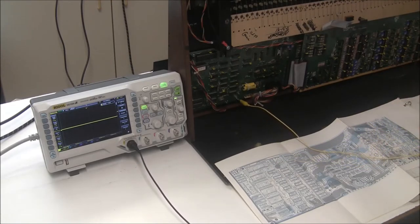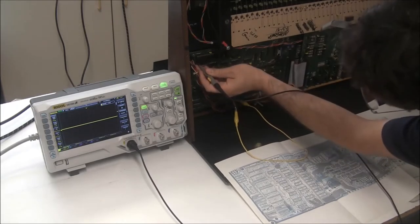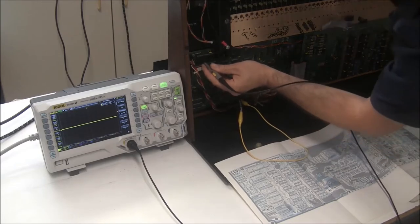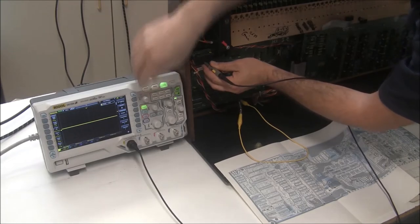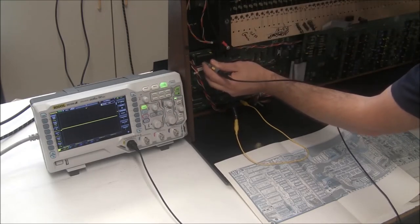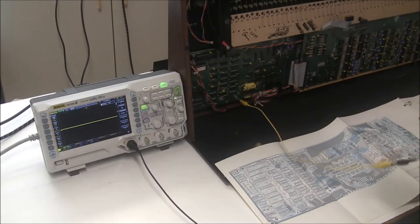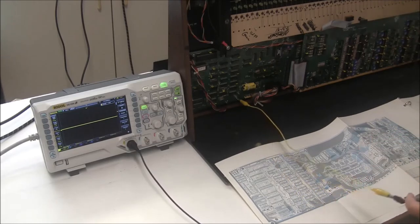The other input the CPU needs to run correctly is the clock, which comes in on pin 6 — so I'll come down here: 2, 4, 6. The keyboard's off — I'll turn it on, and I saw it budge up a little bit but it's not a 5 volt square wave like it should be. So we're not getting a clock into the CPU, and without a clock it can't execute any instructions. We're in the right direction, so now let's work our way back.